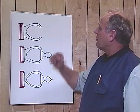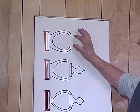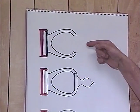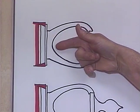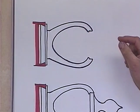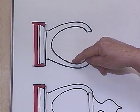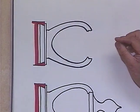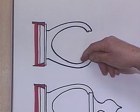I'm now going to explain the last three stages in the development of this box. First thing we do is to remove the lid, and then we excavate the interior. This is hollowed normally with a 3/8 spindle gouge. It's then refined with a side cutting round nose scraper, which comes round here and pulls through. I have one that is modified somewhat, which allows me to get back under this shoulder.